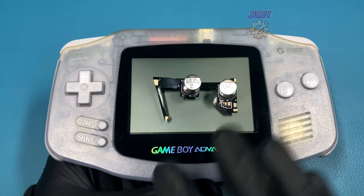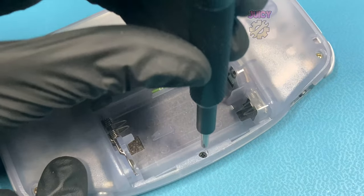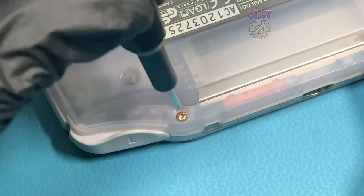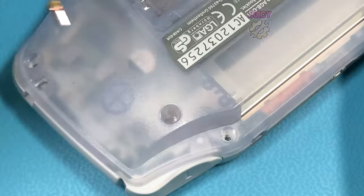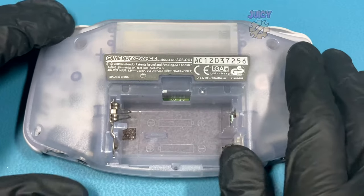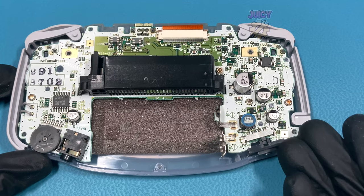Let's start with the Gameboy Advance installation because this one definitely looks different compared to the Heldatech version. Flipping over the Gameboy Advance, removing the battery cover, and then removing all of the screws from the back of the shell. With all those screws removed you can remove the rear half of the shell, and luckily this is as far as we need to go - we only need to concentrate our effort on the right area to install the hiss kit.